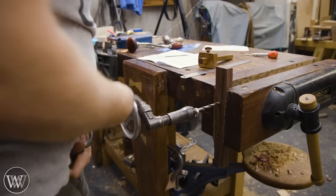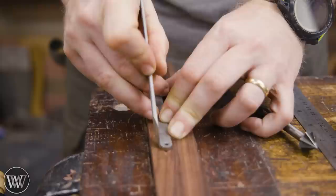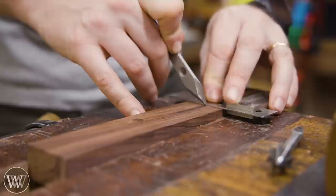Then we're gonna come up with a smaller bit just inside of that and drill in farther. This will be what we actually cut the threads into, and the plans specify all the thread sizes as well as provide the tap. The tap then provides the threads that the depth adjuster will ride into.